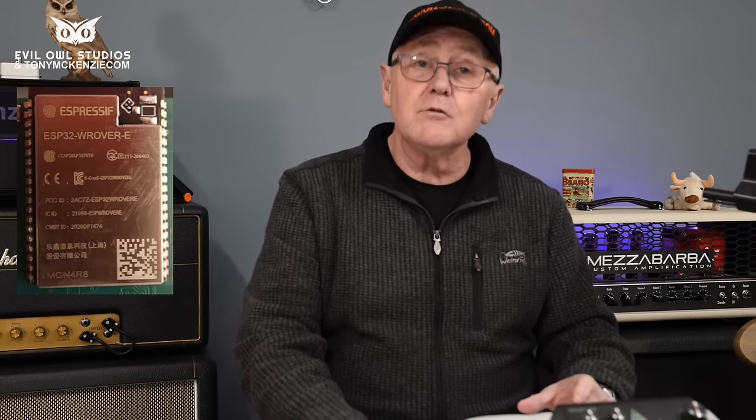The integration of Bluetooth LE and Wi-Fi ensures that a wide range of applications can be targeted and that the module is all-around. Using Wi-Fi allows a large physical range and direct connection to the internet through a Wi-Fi router, while using Bluetooth allows the user to conveniently connect to a phone or broadcast low-energy beacons for detection. The sleep current of the ESP32 chip is less than 5 microamps, making it suitable for battery-powered and wearable electronics applications. The module supports a data rate of up to 150 megabits per second and 20 dBm output power at the antenna to ensure the widest physical range. As such, the module does offer industry-leading specifications and the best performance for electronic integration, range, power consumption and connectivity.